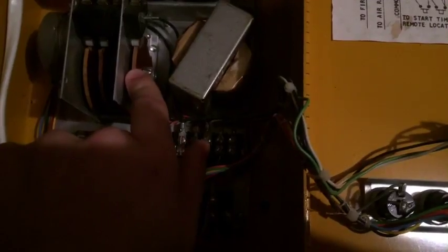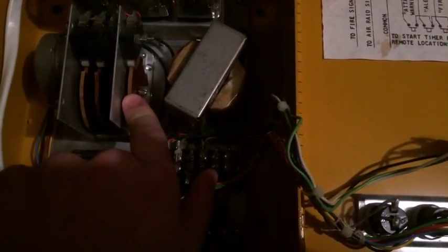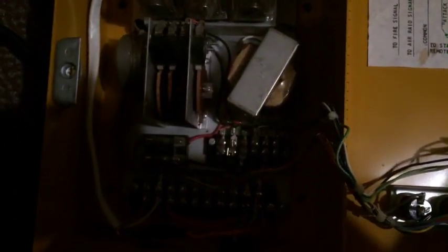Now there are two types of AF and AR timers, other than the series AR — like series 1 and series 2. These are the standard AF timers, both of them. Both of them have the 3-minute cam cycles. So what that means is, if I were to press alert, this timer is going to cycle for 3 minutes — you'll have a 3-minute alert cycle.